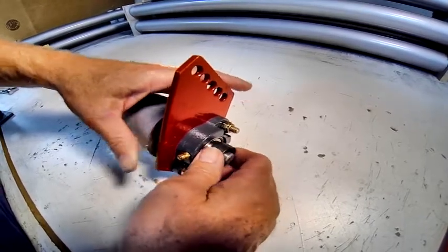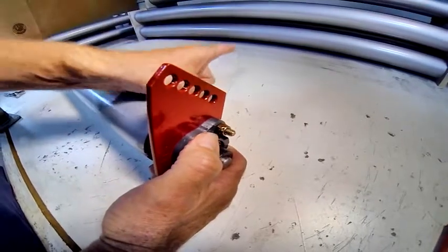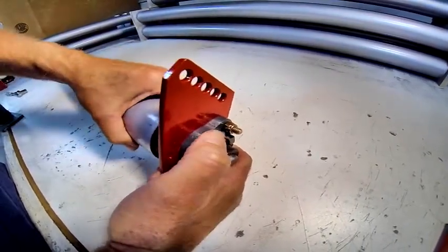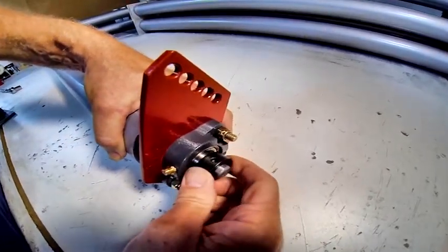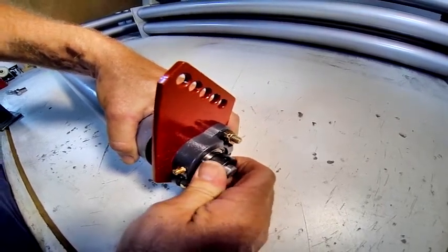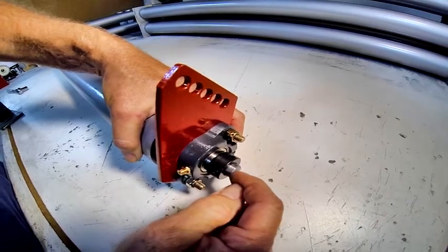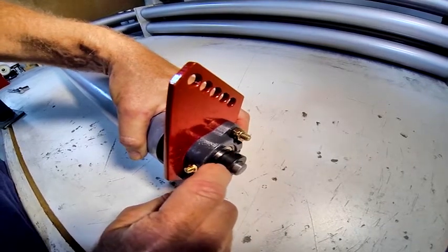The way to figure out how to do that is: when this is mounted on your machine and you're going to go that direction, the roller will be turning this way. So you determine which way the roller is going to turn, and then you turn the collar the same way until it locks. Now I can't rotate it anymore — the shaft is locked to the inner race of the bearing through this eccentric collar.